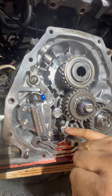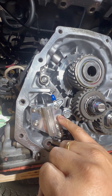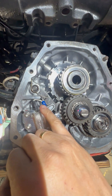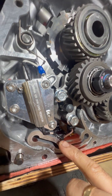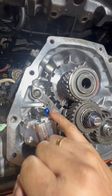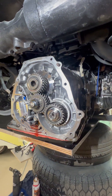I got the backlash correct before I did those up tight. All four bolts that hold the block-off plate are tight. The two little M3s that hold the resistor in are tight. I've wired the resistor in using the standard plug from the 4EAT transmission, with heat shrink and solder joining that in, and there's a little terminal going to earth.